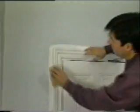In addition to rubbing down the filler, should there be overpainting onto the substrate from areas such as architrave, skirtings, and window frames, we would advise that these areas are also rubbed down using an abrasive paper to provide a key for the wall covering adhesive.